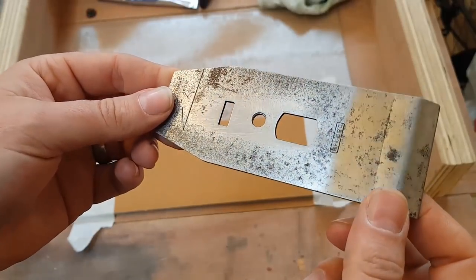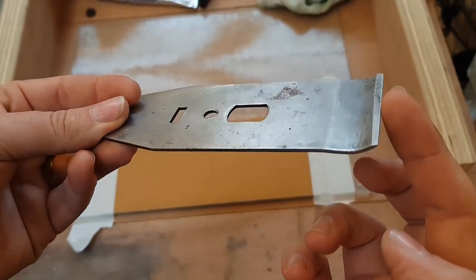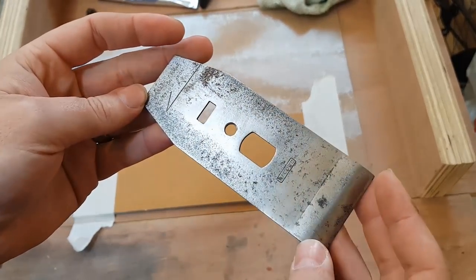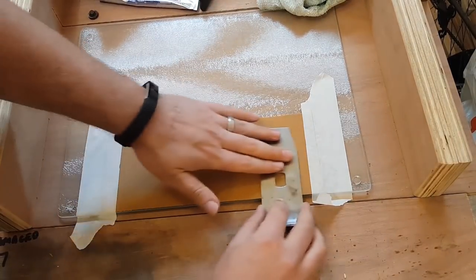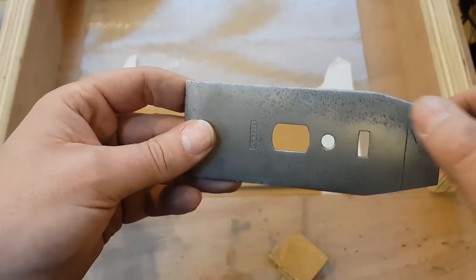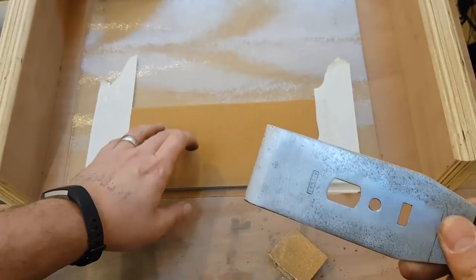The chip breaker has got a little bit of surface rust that we're going to get rid of, and there's a slight unevenness on the edge here which we can start to level out — just working on some sandpaper to bring it back to better condition. After I started sanding this I realised it was a bit more pitted than I first thought, so I used lower grit sandpaper to cut through as much as possible and then came back and finished it.